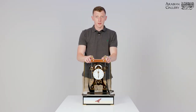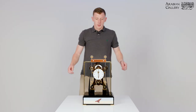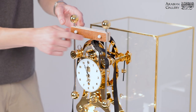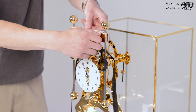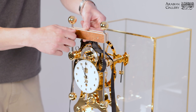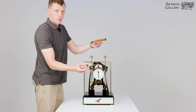The pendulums are secured via the two wooden clamping blocks, and the escape wheel is secured via the ribbon. Before removing either, remove the cardboard section at the bottom. The next step is to release the pendulums from the wooden clamp using the two plastic screws. Hold the wooden clamp with one hand and remove the screws one at a time with the other — it comes away in two halves.